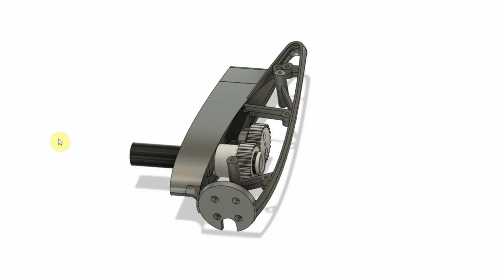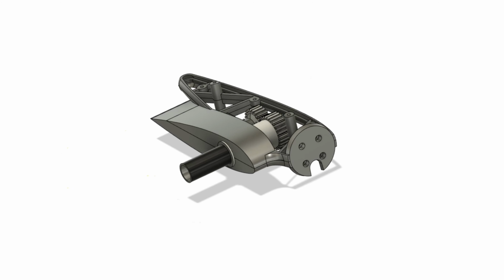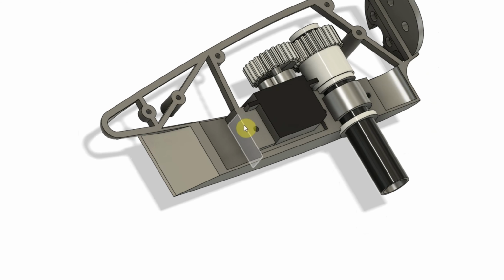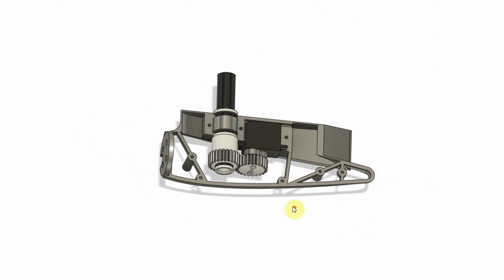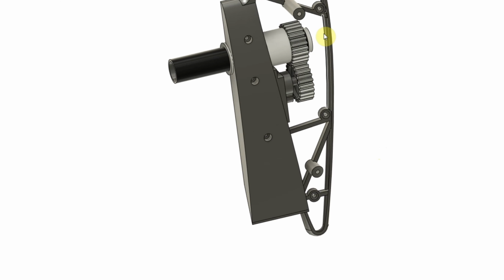Vertical thrust is really not an issue with this. The motors and prop setup are more than capable. So I shortened that up a little bit, and that shed some more weight. So basically we have a top and a bottom here, and if I shut the top off, you'll see that we have the same ES08 servo and the drive gear, the idler gear, the needle bearing, and the two printed washers. The structure is kind of a truss structure here.